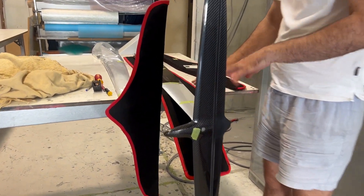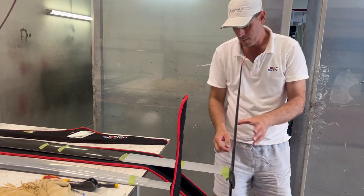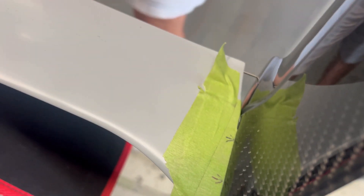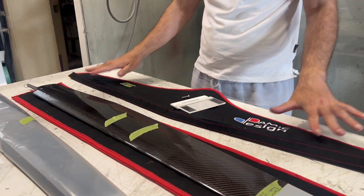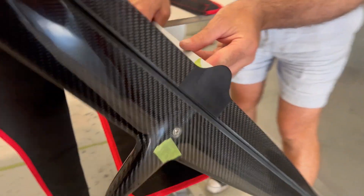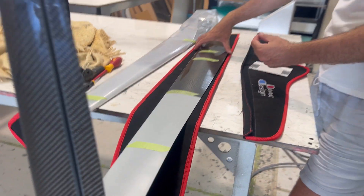When this is sent, it will be pulled apart — the push rod pulled out, bell crank typically stays on. I've marked lines here where you can see exactly when it's inserted all the way. The first step is to have your horizontal and vertical, grab the push rod out of the vertical, remove the fork fitting at the top, and wind the push rod into the barrel nut. Mark on the vertical — I normally put a mark right on that push rod so I can see how many revolutions I'm putting into the barrel nut.